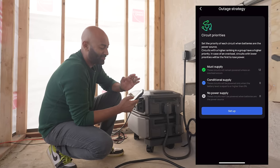Currently we have roughly 6 kilowatt hours of energy storage, but we're going to stack that up in episode 2 or 3, we'll see, all the way up to around 30 to 40 kilowatt hours. And I believe with the 5.6 kilowatts of solar input, plus about 35 to 40 kilowatt hours of battery storage, we can run this business entirely on sunshine and be net zero, which is always my dream. It hasn't been easy and we are not done. There's going to be a ton left to do. As you can see, there's still siding and frame finishing up here, and solar installation. Episodes 2 and 3 should cover all of it.